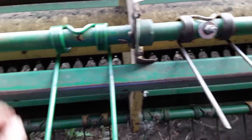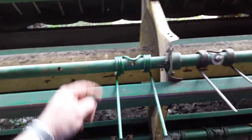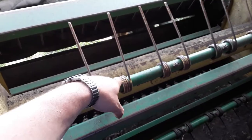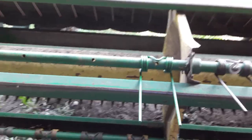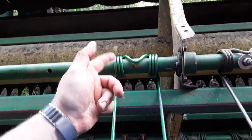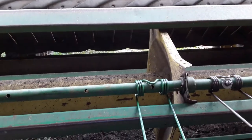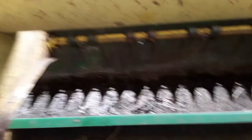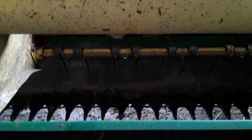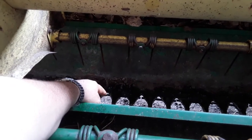There's a new tooth - got to go on the proper way. Nothing's more frustrating than when you change one of these reel bars in the field because it just snapped, and you put all the teeth on backwards, put the bar in, go to bolt all the bolts, and realize all the teeth are on backwards - not that I've done that like three times. So why go through all this trouble for one or two teeth in the middle? Because this thing likes to plug. If you give this thing a reason to plug, it'll plug. It's already frustrating enough with the molehills and a sickle cutter because the sand will sit right behind on that flat spot and the grass won't go all the way in to get cut.